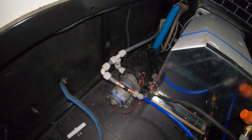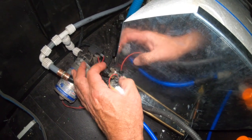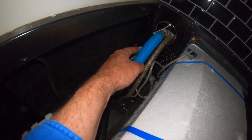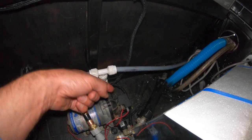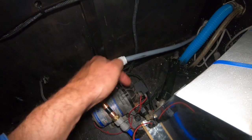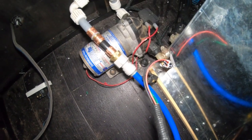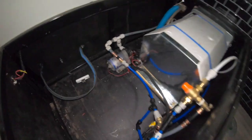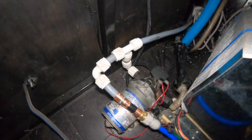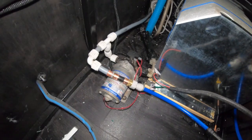So I gave the guy a call and said look, this pump's quite old - do you want to just put a new pump in and also just get rid of this? They've got these really nice little clear plastic filters that fit especially for this pump. Get rid of this retic filter - that's mainly just for the retic anyway. And also when you hook onto the pressure from the mains at the caravan park, this all builds up pressure and that pressure can go back into the pump. So there really should be a check valve in between here and the mains so that pressure can't come back to the pump anymore. I think that's probably the best thing - cut that whole section out, fix up, put a check valve in, put a new pump in, give it a little bit more room, whole new suction line onto the tank below. I reckon that would sort the problem out.